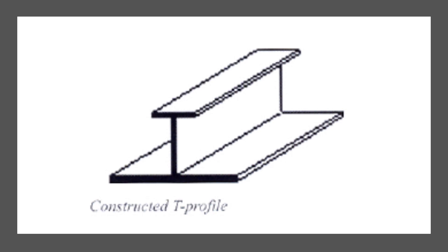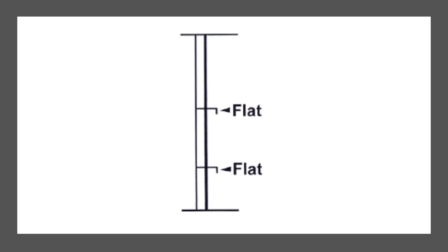Stiffeners can be chosen from a range of types; the most used are flat bars, inverted angle bars, and what are known as Holland profiles or bulb flats. These are hot-rolled sections. Web frames and stringers can be made from similar profiles, but this is impractical in most cases — normally these beams are constructed from plate with a flange or with a face bar.